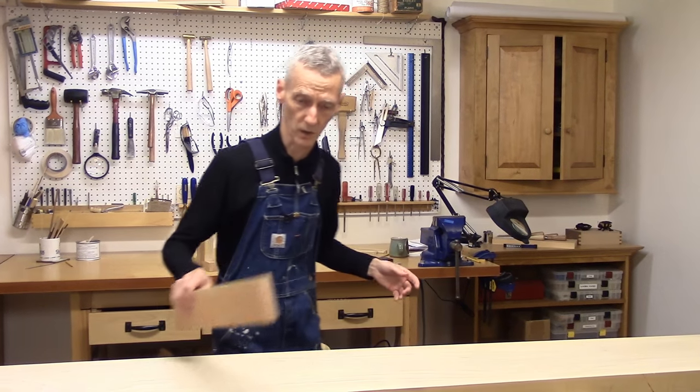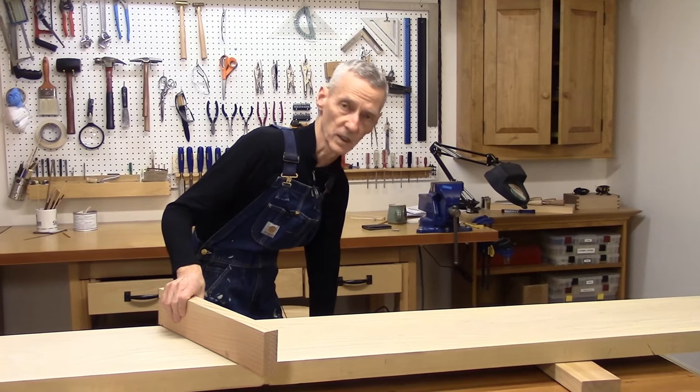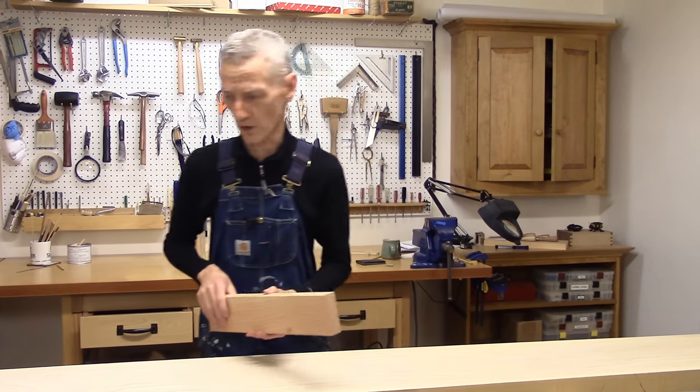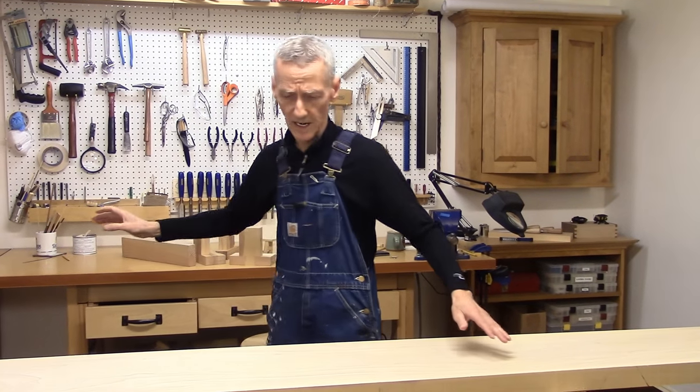They're also lower. They're about 20 inches. That's about the ideal height for a saw bench, so that your knee can bend exactly where it needs to when you're sawing. So that is that. Now, there are many, many different designs of saw benches.